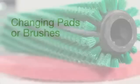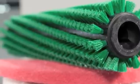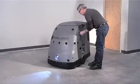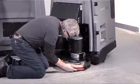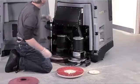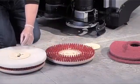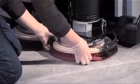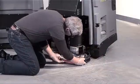Changing pads or brushes: this section describes the procedure for changing pads or brushes on the HydroBot floor scrubber. Depending on the floor surface, the robot can accommodate various grades of pad or brush abrasiveness. Power down the robot by pressing the on-off push button. Unlatch the front cover and pivot open. Remove the pad driver or brush by applying a quick turn towards the center of the machine, then slide it out from under the brush head. Remove pads by squeezing the lock hub on each pad driver. Reinstall each pad by centering it on the pad driver and locking the hub by pressing and snapping it into place. Reinstall the pad driver or brush by aligning the three pad driver alignment studs into the drive hub alignment slots, then lock the pad driver into the retaining clips by applying a quick turn away from the center of the machine.